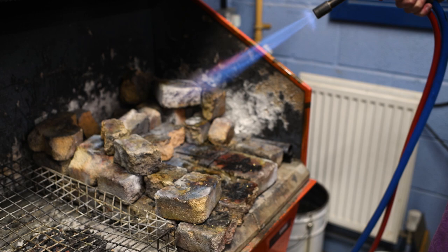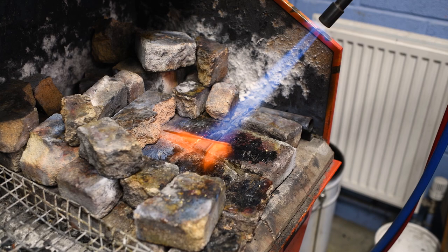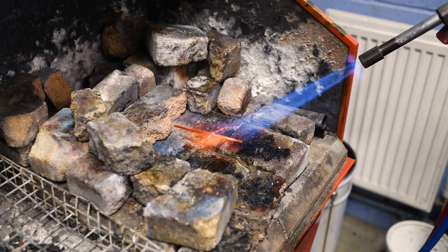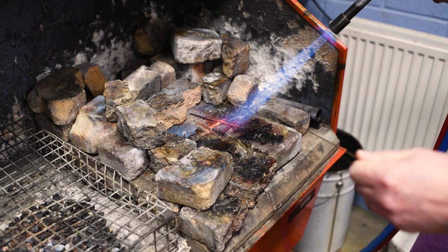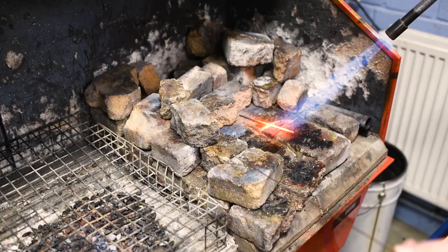The gas has been switched on, now the air is on, and I'm heating at the hot spot of the flame. A little bit later I will demonstrate what happens when you don't have the hot spot of the flame on the two pieces of metal. You'll notice I'm now moving the flame around to heat the metal. As this is the first one of the day, the bricks are still cold and are therefore removing most of the heat. In my hand I have the brazing rod — that is the extra metal I'll be melting.